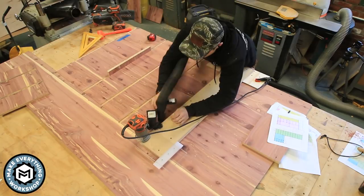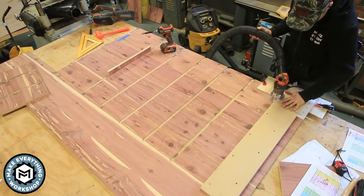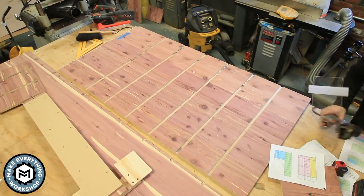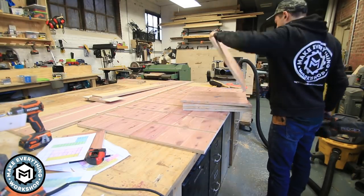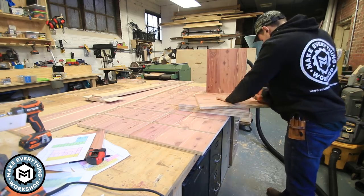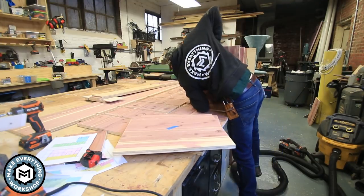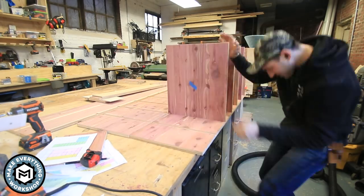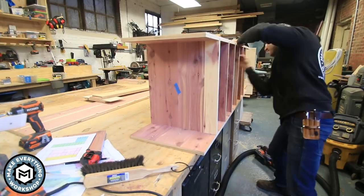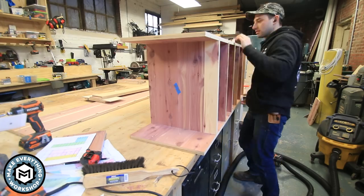The three-quarter inch fit I used was pretty tight. Usually three-quarter inch plywood is slightly undersized, but because of the properties of this veneer it measured a tiny bit heavy over three-quarter, which gave me a really nice interference fit on all these shelves. To get the shelves in, I had to bevel the edges that went inside the rabbets - I used a cordless belt sander for that. The bevels won't be seen because the whole thing gets a face frame and nosings on the shelves. It's important to do a test fit like this, especially the first time using a new jig.